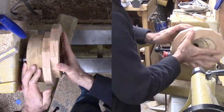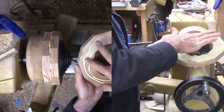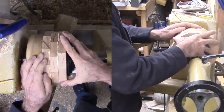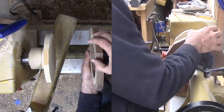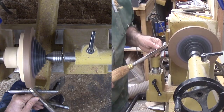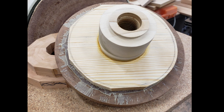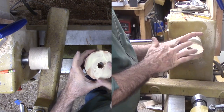To do this, I need to glue these three rings together. I also need to mount the top walnut ring to a faceplate. I'm using a 3D printed centering stack to position the ring. This also enables me to immediately turn the perimeter of the ring. Turning quickly leads to interesting glue patterns as the squeeze out spreads with the centrifugal force. Meanwhile, I also need to start from the base by gluing the base ring to a faceplate. Off camera, I will mortise in the plywood for the base ring.